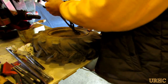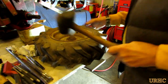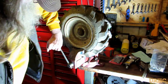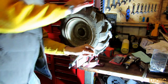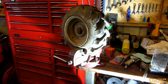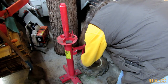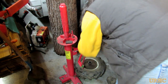You can see that's a pretty big roll pin holding that on. Once you slide it out, the wheel pulls right off. I started by ripping the valve off since I knew I was putting a tube in. Usually small tires you can just pop them right off the rim, but I couldn't hammer it off, so I gave it a quick squeeze in a vise — and just couldn't break it loose. It must have been on there for 35 years. The bead of the tire had rusted tightly onto the rim, so it was really hard to get off. I had to move some wood to access my little Harbor Freight tire machine.